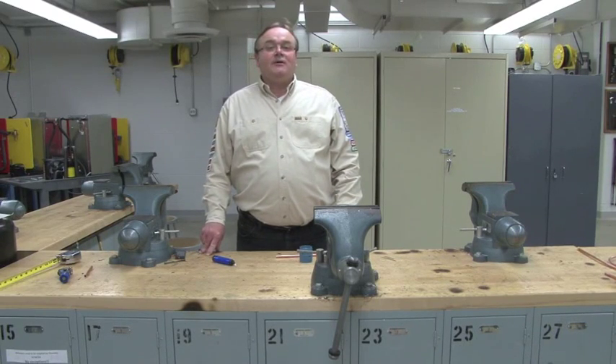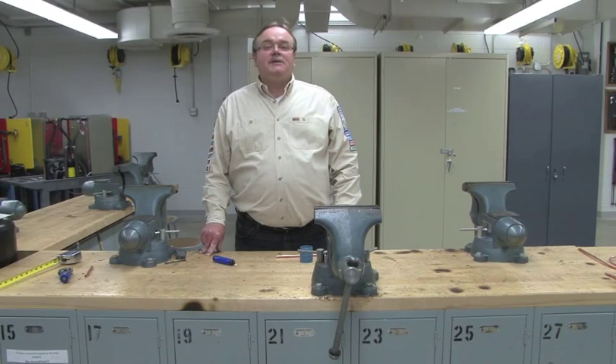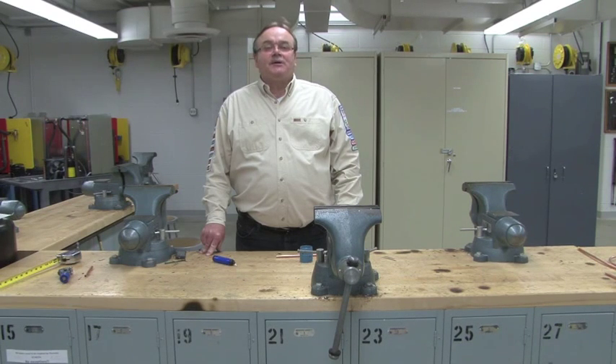This is a video on copper tube deburring. Copper tube acts as the arteries of the refrigeration and air conditioning system. The burr acts as plaque, as in your own arteries. If the compressor is not receiving the right amount of refrigerant coming back to it, it will eventually burn up. So it's very essential to remove the burrs in your copper tube before assembling and soldering or brazing them.